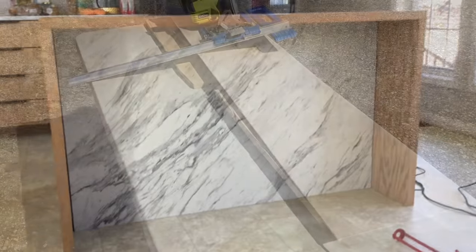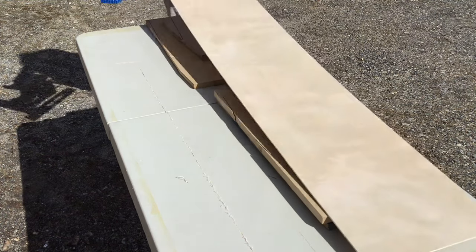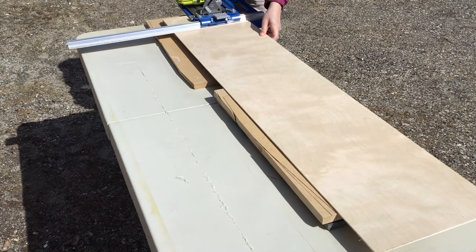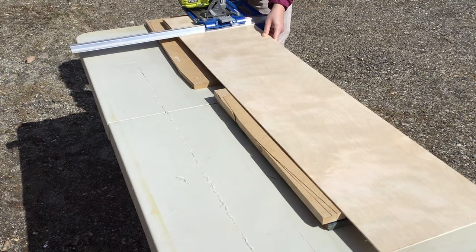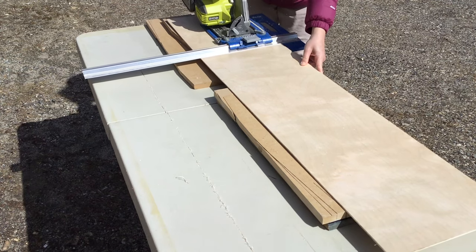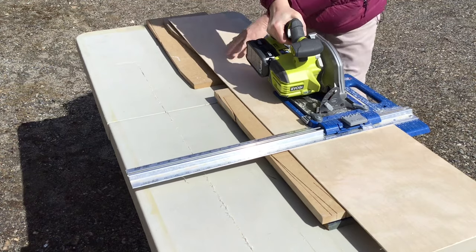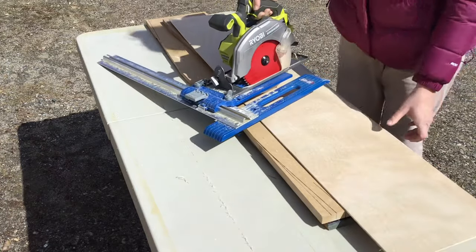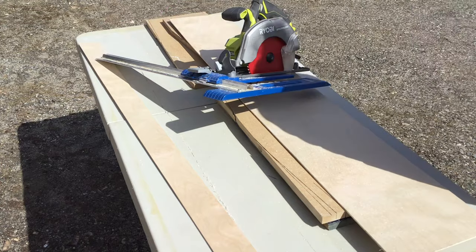Let's just get this glued on there. To attach the laminate to my kitchen island, I used small wooden strips on the back of the cabinets, and then glued onto those to attach the laminate slash plywood. I do not recommend gluing the laminate or plywood directly to the cabinets or a wall. I had a bad experience once trying to remove a mirror that had been directly glued to a drywalled wall, and I will never put myself or anyone else through that again. Just in case I want to remove it someday, they can pull it off because those nailed pieces of wood will come off and it won't destroy the entire back of the cabinets.